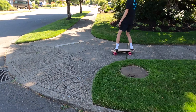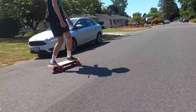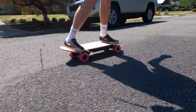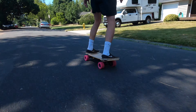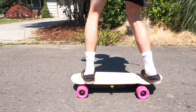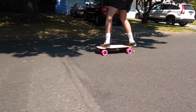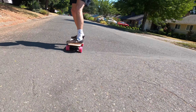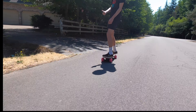This board also isn't a perfect DIY electric skateboard — there are several things I would change having built it. The first thing I would change is adding some riser pads; this deck is so short and not really intended for these big wheels that adding some quarter inch riser pads will make a world of difference in eliminating wheel bite. Another thing, as I mentioned earlier, is changing the mount — an idler tensioner mount is a high quality mount that's not really needed on a build like this, so if I were to do it again I'd just buy a standard Boardnamics Caliber mount because it's easier to adjust belt tension, easier to mount, and takes less space on the underside of the deck, eliminating the need to drill those extra truck holes. The final thing I would change is the battery — while a 6S 2P is a great beginner battery that provides good speed and range for beginners, it's not going to be enough for someone that still wants a short board but wants higher-end specs. For that I'd upgrade for just $100 more and get a 10S 2P 30Q pack, which will get nearly double the speed and double the range.